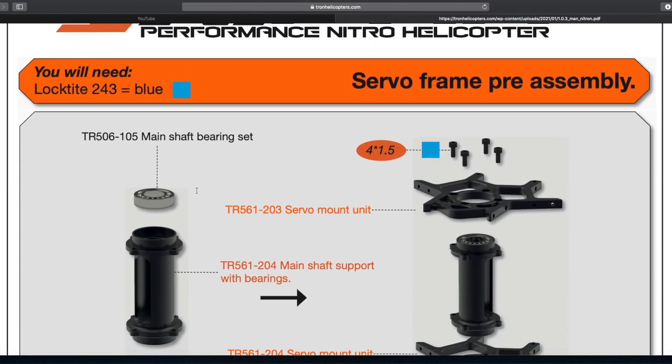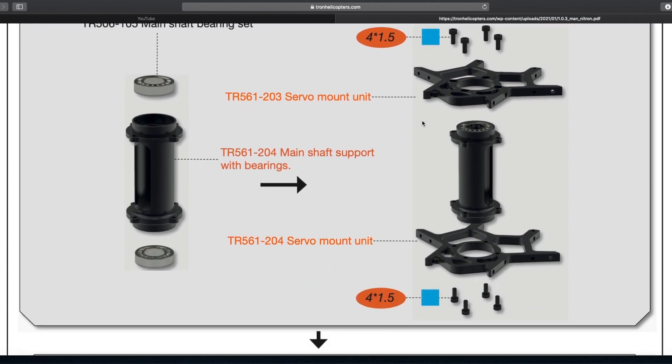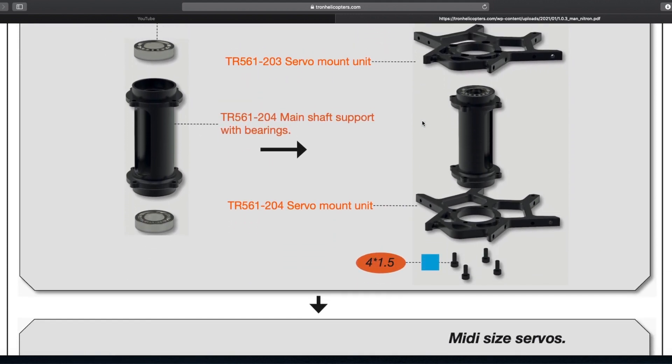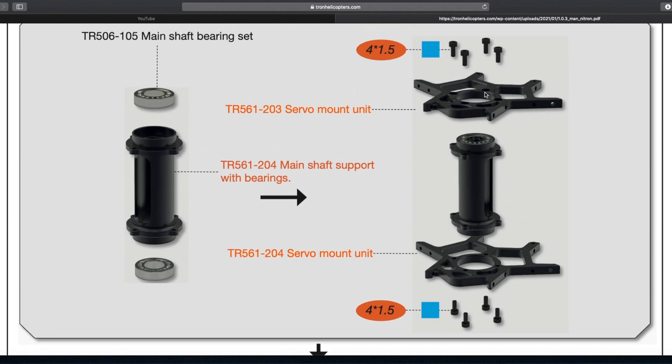Here's where we're arriving in the manual. This is pre-assembled from the factory — you don't have to do anything. I'm going to insert my main shaft though, like we just talked about. Then it shows you how to put on the servo cages. Pay close attention because there is a little recess and the screws are also going to be recessed. If you put them on upside down, the collars of the screws will be sticking up and you'll get interference with parts. Just pay close attention to the recesses and orientation.